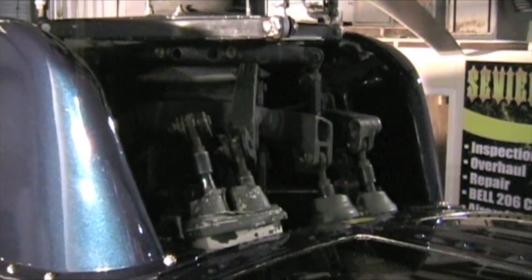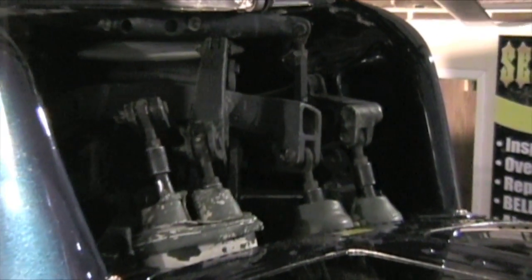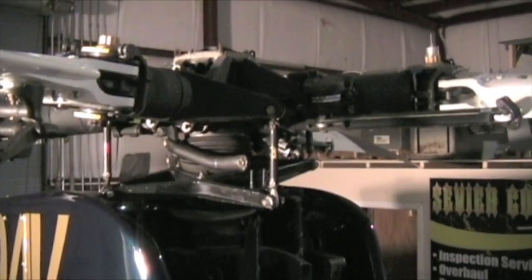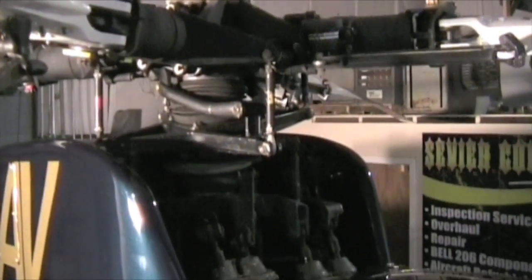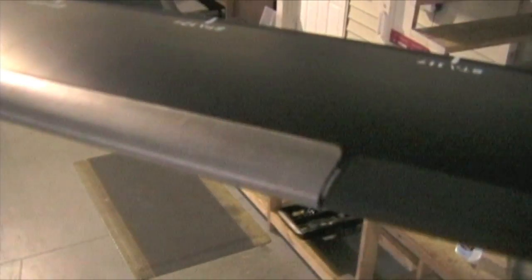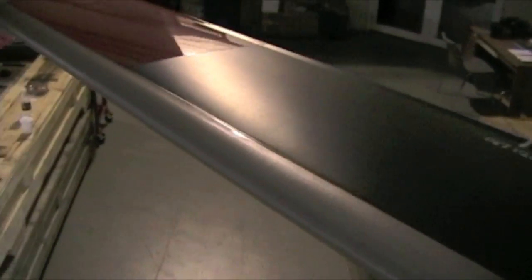It's a kind of cool setup how all this stuff works — pretty cool. Alright, so inspecting the top of the blade: here's your trim tab with station 105, 111, 117 — that's for track and balance. Here's your abrasion strip; make sure that's nice and clean.